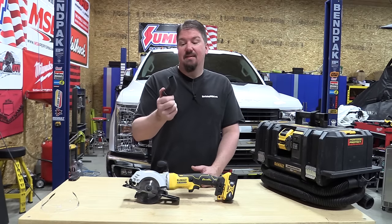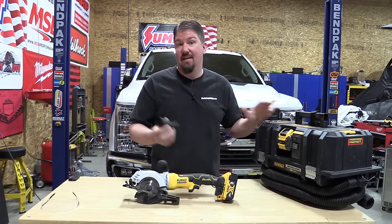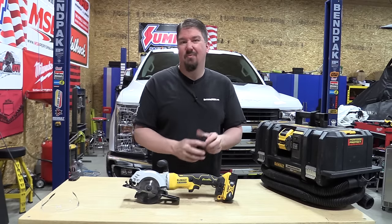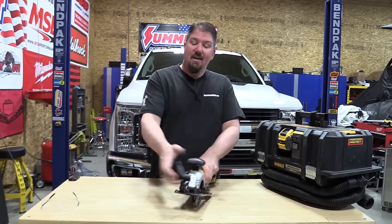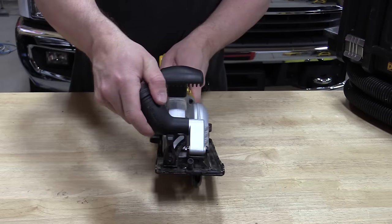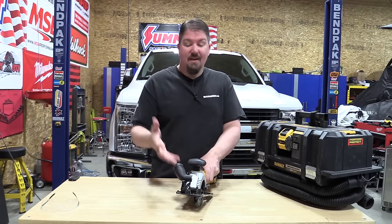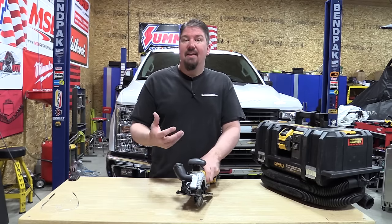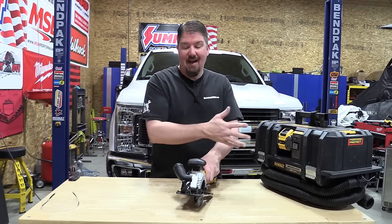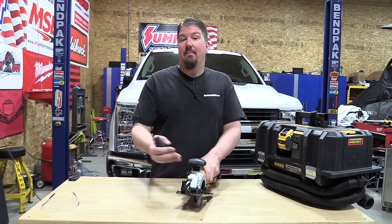Dust collection for this is probably going to be interesting for someone to find an adapter to fit this unless you have one of the DeWalt vacuums — as we showed, it fits perfectly there. I'm sure anyone who really wants to make something for it can do it without much effort. The friction fit on the front is fairly normal, but eventually I can see there just not being enough there, and it's going to work itself to where it isn't solid anymore. For us it worked well except on sheet goods, where we didn't get as good dust collection — larger chunks fly away rather than going through the vacuum. If you're cutting indoors it's not as perfect as it would be with flat one-by or two-by lumber.